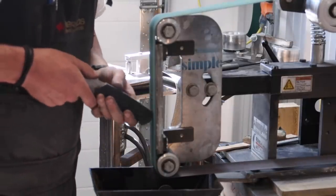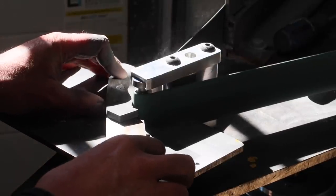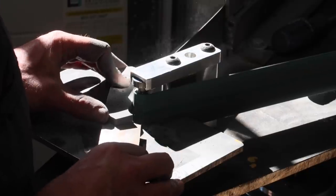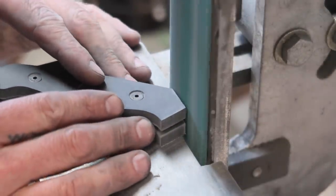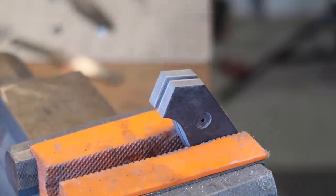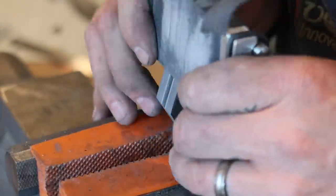This is the fun part — this is where it kind of really starts to take shape. Once we're done on this grinder, we'll jump to the horizontal grinder and clean up some of those smaller inside radiuses. I want this step kind of finished here — I need to make sure everything is really nice and smooth with no bumps or ripples. Essentially this is going to be a finished surface, except for when we add our rock patterning on top of it. Now we've taken the blade out — the scale on the bottom is longer than the one on top; the top one was brought to final dimension, which is how I get the two to match exactly. Then we'll put them in the vise and hand sand to get rid of the directional scratches from the grinding belts. We want this as a finished surface now because it's hard to access once it's on the knife.